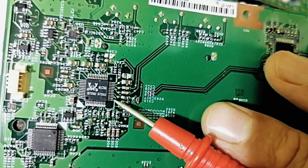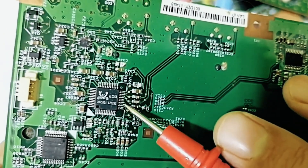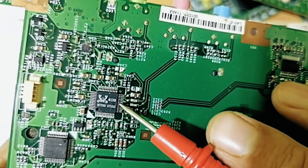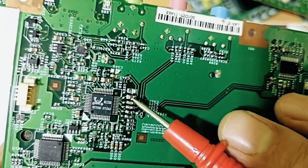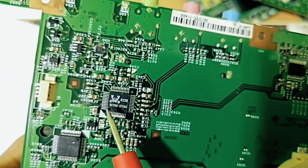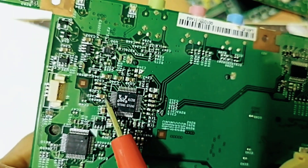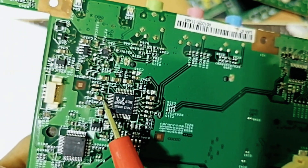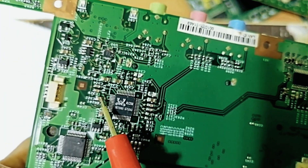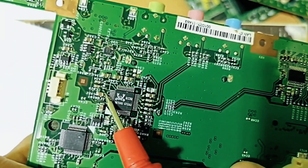For the audio control IC, all these are just control signals — thin lines — and we have extensions as covered in the previous video. You will find that all pins of any IC are connected to series capacitors or resistors. That's why when looking for power, you look for the bolded line — that bolded line means VCC. The VCC is connected to a series capacitor. So if you don't find VCC at the IC pin, you should check those series capacitors to see whether they are good or not, because the capacitor feeds the IC with VCC.